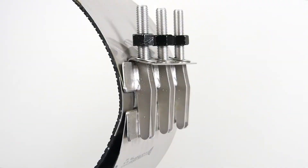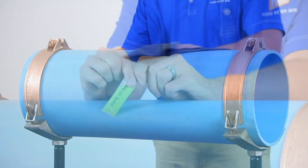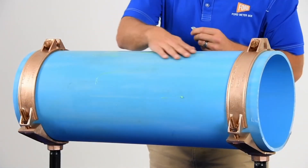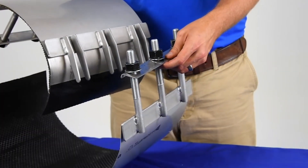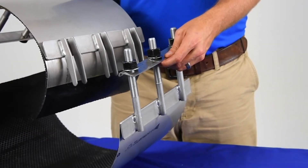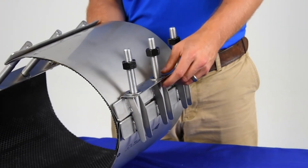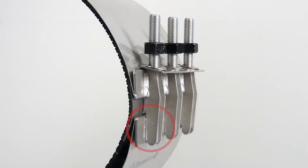Once the bands are properly formed, the lifter bars should be on an even plane. Be sure to clean the pipe and lubricate each gasket or section of the pipe to be repaired. For installations with multiple bands, place the studs of one section between the finger lugs of the other section, ensuring the finger lugs are on the outside of the clamp and resting against the side bar.